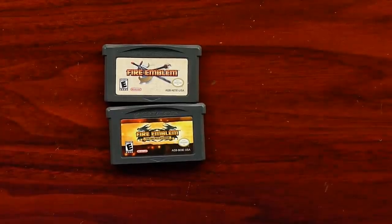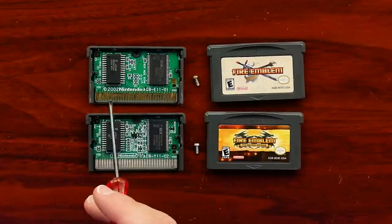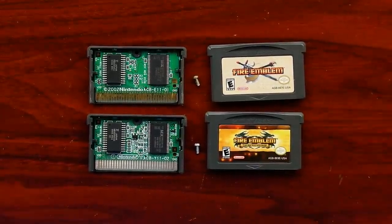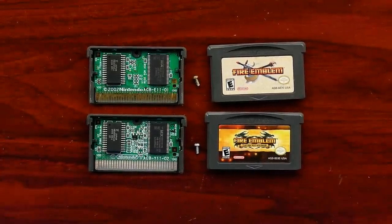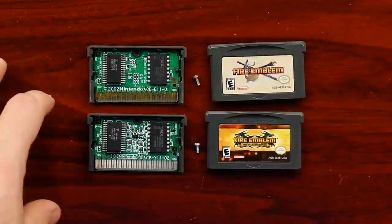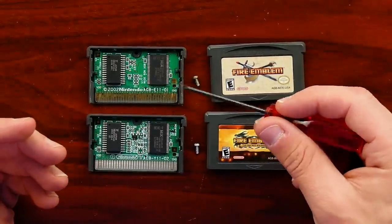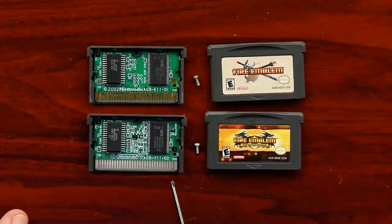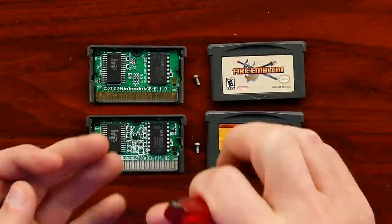I do have the tri-tip screwdriver here, so I can open these up and double check them. A quick look at the boards - they do look authentic, completely legit. Sometimes you'll see bootleg cartridges that have a battery even though Game Boy Advance games technically don't need them. The reason Pokemon games like Sapphire would use a battery is to keep the clock going inside the cartridge. When they made the shift to Game Boy Advance, they used flash memory that did not require that typical battery we have in Game Boy and Super Nintendo games to keep save data. You can see Nintendo's etchings on here, there's no battery, and we have actual mask ROMs that seem legit. The Sacred Stones board looks to be in better shape, while the pins on the Fire Emblem one could use a bit of scrubbing and cleaning.